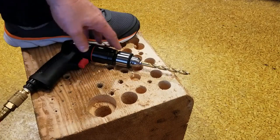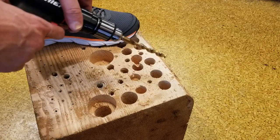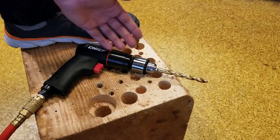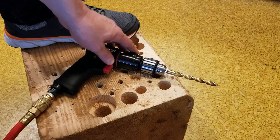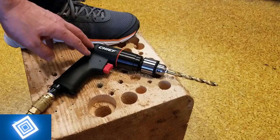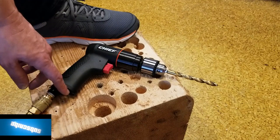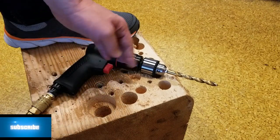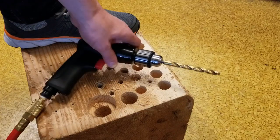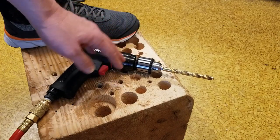I'm definitely underpowering it, but even proportionately it had plenty of power running at low PSI for quite a bit of drilling. The big advantage with air tools is always that they're compact, still built pretty well even with various flaws, and as long as you don't get stuff in the air inlet — this has a coarse screen but not a very fine one — you can use them in virtually any environment. Literally, you could use this underwater if needed, or buried in mud while drilling holes. That's the big difference with air tools: they can take the most extreme environments.